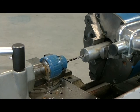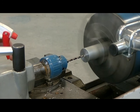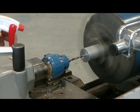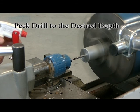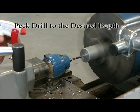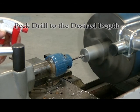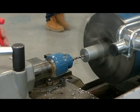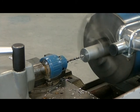I'm going to back the drill off a bit and restart the spindle. I'll mist the tool with coolant to help prevent aluminum from sticking to the drill. I'll drill in a bit and hesitate or back off to break the chip, mist it, then drill in a bit more and back off to break the chip and pull it out. I spray a little coolant on and watch my depth, drilling until I'm between an inch and five-eighths and an inch and three-quarters in, then remove the drill.